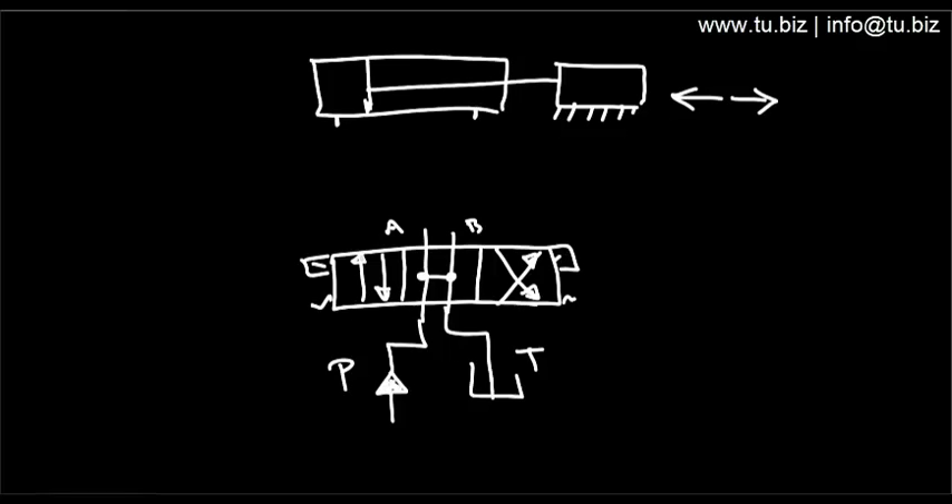The way to do it is by putting check valves here. You have one check valve connected to the cylinder, and you have another check valve on the other side — as in a meter-out circuit. You connect the check valves to port A and to port B. That makes a double check valve.